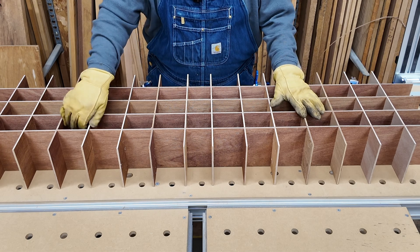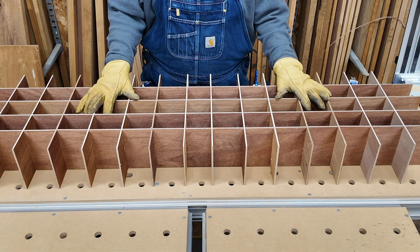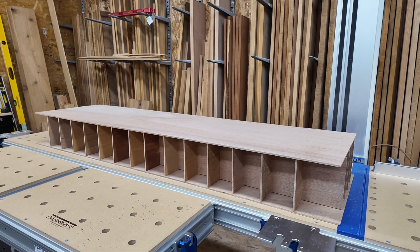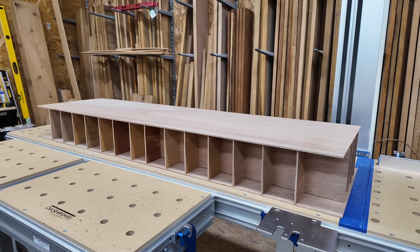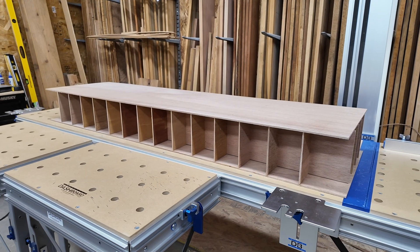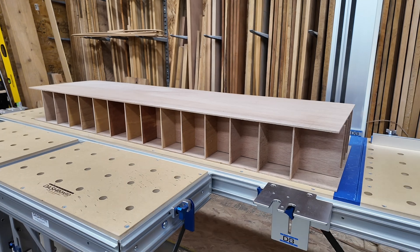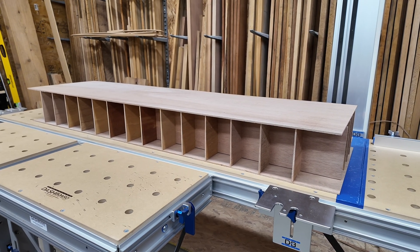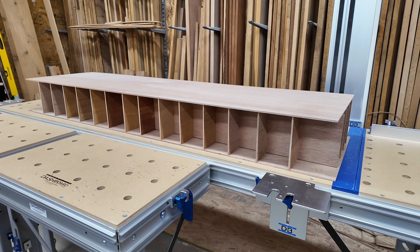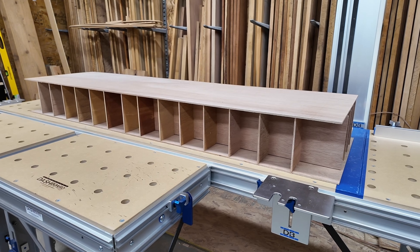Assembly of the grid took just under 10 minutes. Now I just need to cut and glue on the skins. I'm not even going to bother putting sidewalls on it because for this test and demo they're not important — I might want them for looks or for attaching something if this were a bench top — but the real source of strength and stiffness is the grid, not the sidewalls. One thing that is very important is glue. In order for this torsion box to pretend to be a solid beam, the grid ribs need to be one with the skins. Simply using nails and screws will not suffice, and in this case because the grid ribs are so thin, nails and screws wouldn't work anyway.